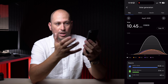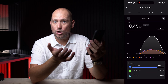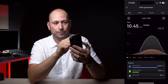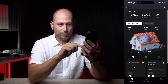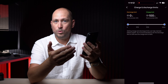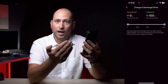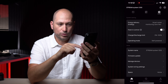On August 4th I made 9.91 kilowatt hours, and August 3rd I made 10.45. This is basically cutting about half of my electricity usage — every day I use about 20 to 25 kilowatt hours but I make about 10 from the solar panels, so my electricity bill should be cut in half. You can also set the discharge limit for the battery packs — for example, keeping the Ultra at 80% and never charging to 100%. You have full control over all system settings.